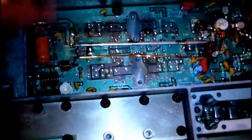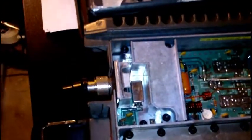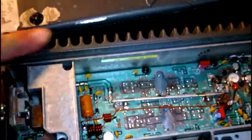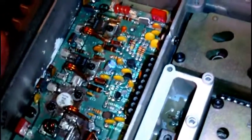You can see it has a pair of blank spaces for, I believe, the 100-watt model. They did make a 100-watt model of the high-band radio — you can tell it's the 100-watt by the fins on the heat sink being longer. We've got one output transistor and what looks like a driver. On this board you set your output power with a pot, so once the radio is up and running you adjust that for the rated power you want.